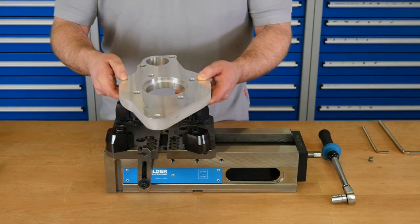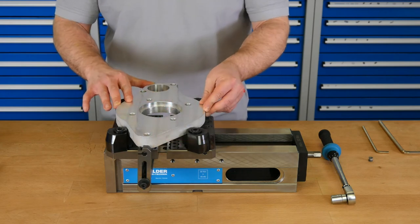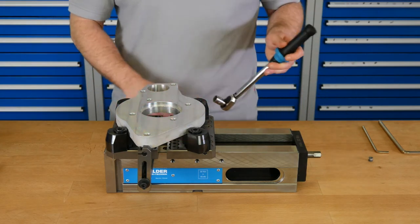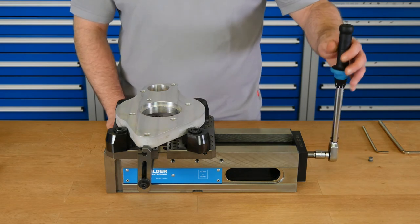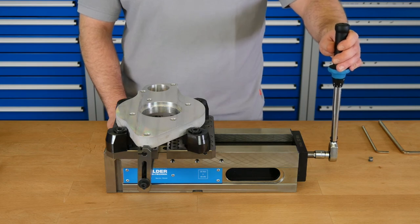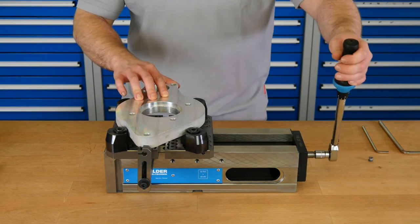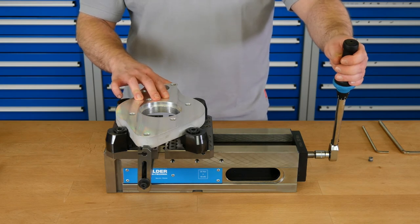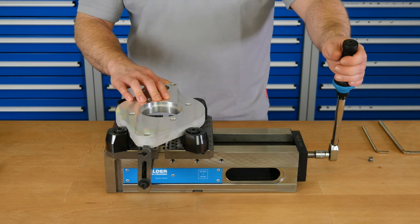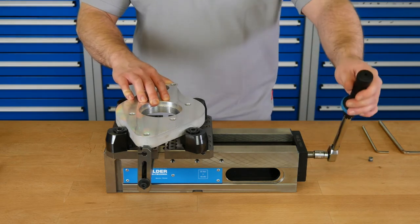That is the workpiece we will clamp right now. I just put it in and push it against the workpiece stop. When we use grippers or pull-down elements and want to close the vise, we have to make two complete turns of the torque wrench after disengaging of the ball clutch to get the full clamping force. You can feel the disengaging of the ball clutch when you turn the torque wrench — there comes a point where it starts to turn easily and you almost need no hand force. At this point the ball clutch disengages.